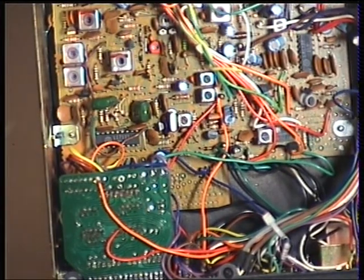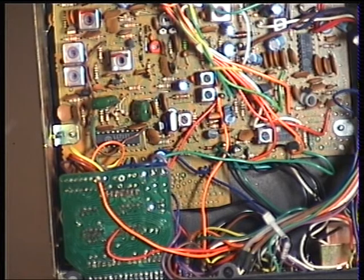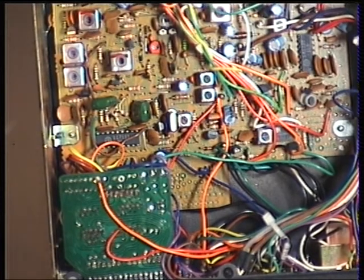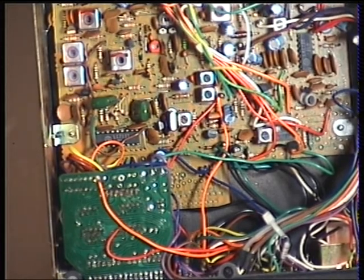By the standards of this NATO 40M chassis, this set is usually outstanding on received performance. What you're hearing off the signal generator is just one microvolt — this set should do better than 0.5. The manufacturer says so. If I switch the generator to 0.5, we've lost the signal, so it's either faulty or it's well out of alignment. We'll start with transformer 5.